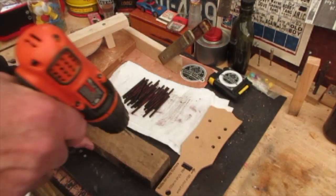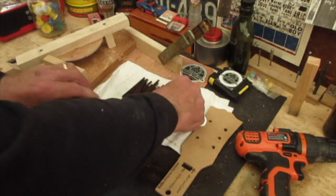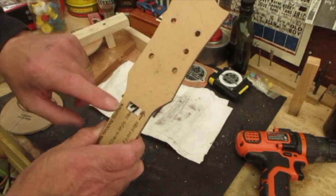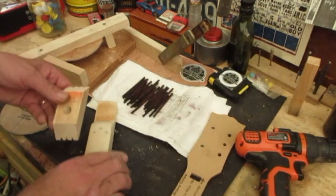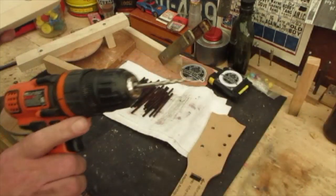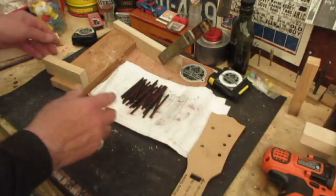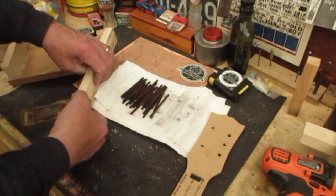I know which drill bit matches these dowels, so I keep it marked and in a known place — just pull it out and stick it in. I've got a lot of templates. This headstock template from Darren Dukes at Delta Groove Guitars I use constantly for marking headstocks and scarf joints. I've got a peg placement template, coffee can jigs for lining up notches and bolts, and the specialty piece: the scarf joint jig.